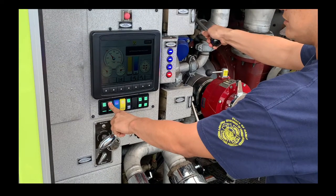You just saw water overflowing — the truck is made to overflow like that when it's full. He was running from the hydrant and filling up by cracking that valve. Now he's shutting down that valve and closing off the tank so the 3,000 gallons he just filled is trapped inside. Then he'll shut off the hydrant, close it off, bleed out all the lines, and he'll be ready and back in operation.